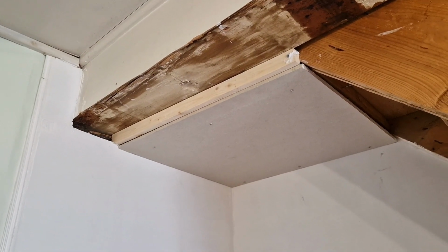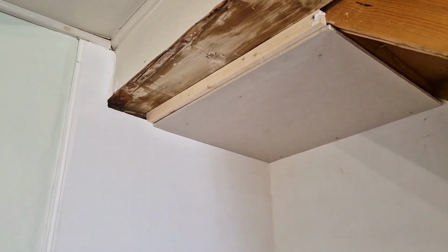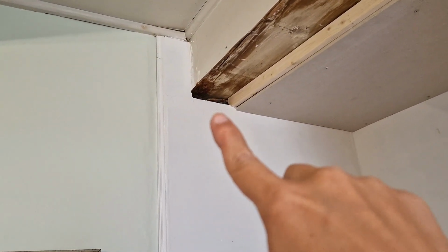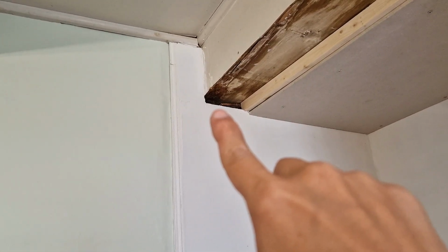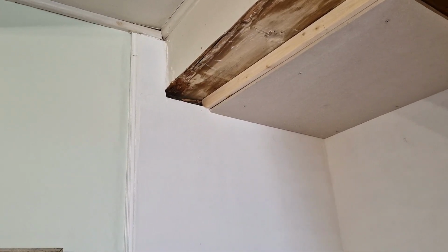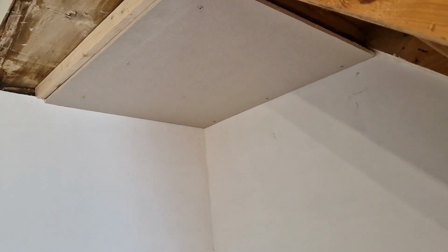I mean, it looks so much better. The two little extra touches that I want to do are to put a little piece of drywall from my leftover drywall in that little hole beneath the beam, just to get that sealed off and solid and looking nice. And also there's a little gap. Let's see if I can put the camera up there.